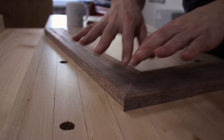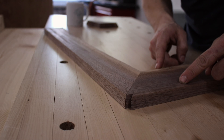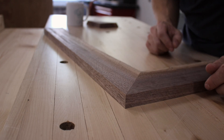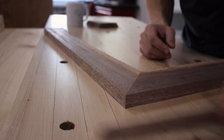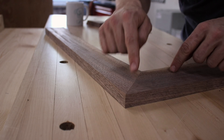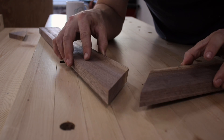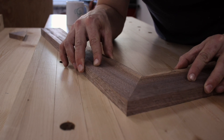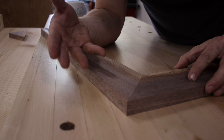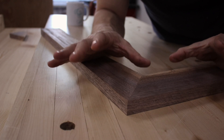I've got my pieces milled and my miter cut done. This piece had to be trimmed because this section of the live edge was wider than the other section, so I wanted to make sure the front and back lined up. I lost maybe a quarter of an inch — that's not going to make or break a shelf. It still tapers out to the end, and as long as this part is at the same width after the miter, we'll have a good lineup. I'm going to install these as two separate shelves that meet at a miter in the middle, and I'll drop a domino in here. You can use a biscuit — that would work just as well. I would use a biscuit if I had a biscuit joiner, but I don't at this shop, so I'll slip a domino in there.